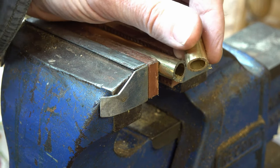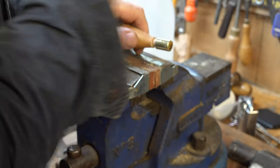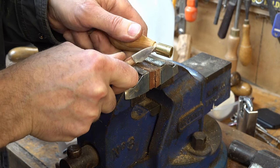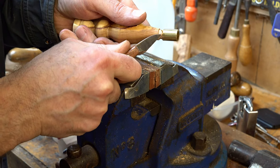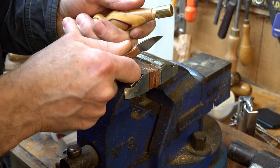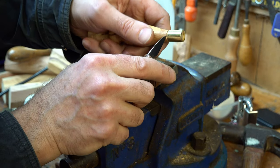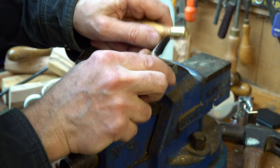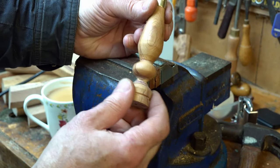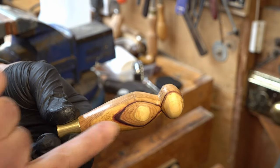That will need a little cleanup with a file — that's my ferrule, so a little bit of interference, but I can coax it on. I may need to just trim it a tiny bit with a knife to get rid of that burr, and then hopefully the ferrule will be on nice and tight. I've put a little shoulder on here so the brass should sit pretty flush with the handle. That's number one off the block — the laburnum grain does come out very nicely.